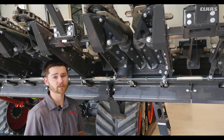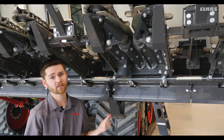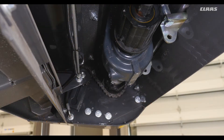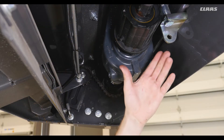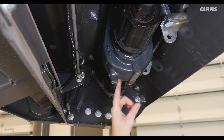We're going to have to reference the operator's manual for fluid specification and oil capacity. Next we'll take a look at our driveline for each row unit to make sure our clutches are greased. Each row unit has its own individual radial pin slip clutch connected to the drive going to other row units.